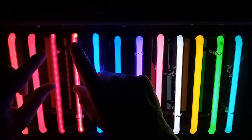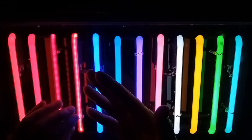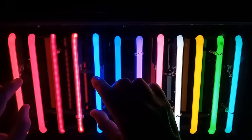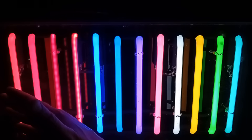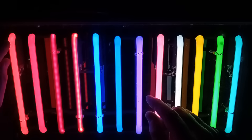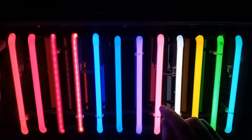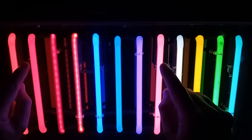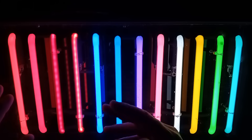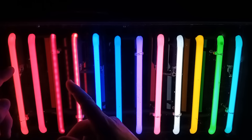Something worth mentioning here is that this is Neon and therefore it's that classic Neon red. It's not showing up too well on camera because of the colour temperature setting. We have the classic Neon red tubes, then a sort of soft orange, followed by a pinkish orange — that may be a white phosphor, and then perhaps a pink phosphor over the Neon. The Neon causes a slight stimulation of the phosphor but not much, so you end up with a very subtle colour change.